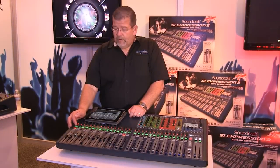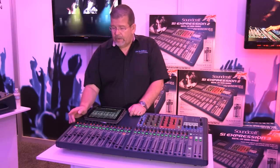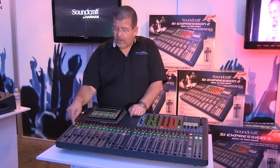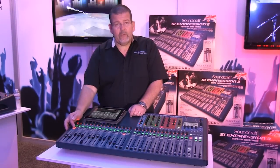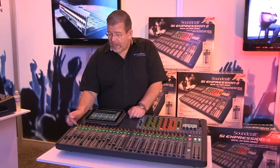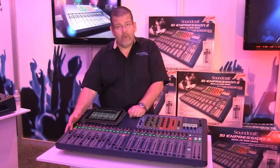What's really cool about this on-off switch is green is on, and off is just blank. You turn it on and it glows nice and bright — it's a nice soft switch. The select switch, which is typical on a digital console, lets you select what channel you're working with. So I select channel 2, 3, 4, back to 1. And then a solo button, so I can solo that channel on a pair of headphones and listen to what's happening — very analog. You also have input-level controls: a signal-present indicator and a 6-LED ladder, plus a nice 100-millimeter moving fader.